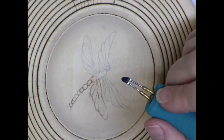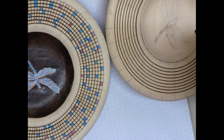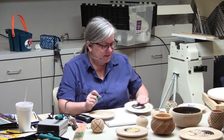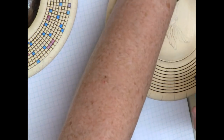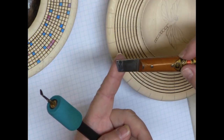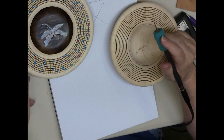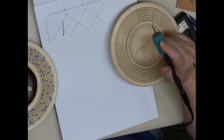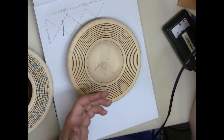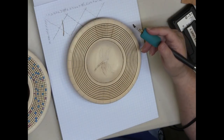On the dragonfly's head I didn't like it, so I took a rotary tool with a googie sander — a rolled-up piece of sandpaper that's glued on a little mandrel — and I sanded it off down to bare wood. If it's a slight mistake you can try sanding it off, or use a little chisel or gouge and scrape it like a scraper. But I actually like sanding with the googie sander much better because it blends in quickly and is a lot faster.